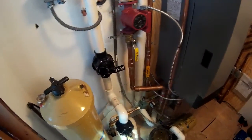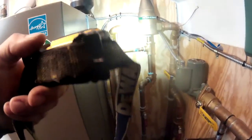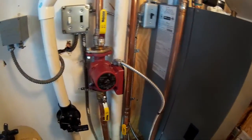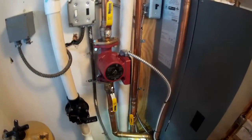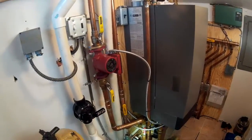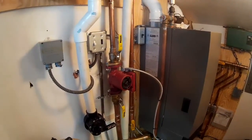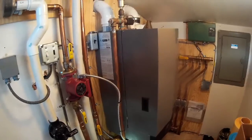There's the pool pumps and the spa filter. It's quite crammed in here — did the best with what I had. Now I just got to fix that leak there. I'm going to replace the T&P because the water's been bypassing it, so it's probably got crap on the seat and it's not sealing up very well. I also got to replace the PRV. When I get back out here I'll shoot another video. I just wanted to show you guys the kind of work I do — boiler work is what I specialize in. For me this is the fun stuff, the kind of work I like to do. That's it for this one — thanks guys, like and subscribe.